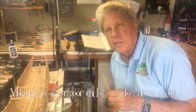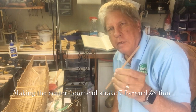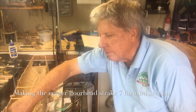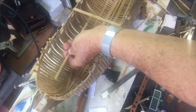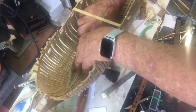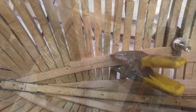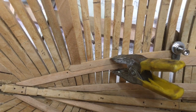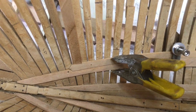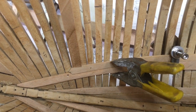The first thing I'm going to do with strake 7 is to make up a very bendy, flexible template that I can fit and adjust to make sure everything is correct. This is made of the same four and a half inch stock, and you can see it fits perfectly in there — of course I can bend it around. Here we have the template put in place and it's a perfect fit. We've soaked the four and a half inch piece and we'll put it in place, clamp it up and use the blow dryer to try and fix the shape.